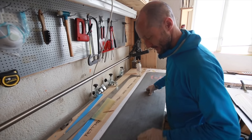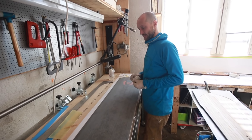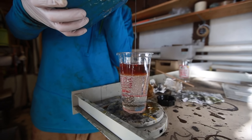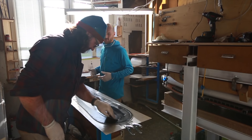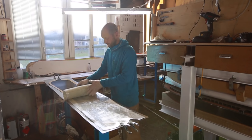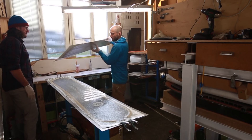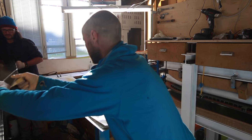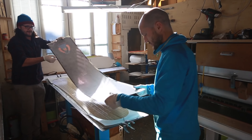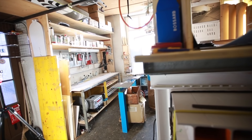This is a top sheet combined with the fiberglass. It's really important to not get delamination — to clean all the surfaces really, really well. So this can always fall off. Absolutely, that's how it feels. We made the whole sandwich construction. It's inside these metal plates now, all the layers together, and now it's going to get pressed.